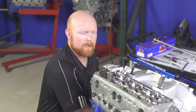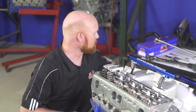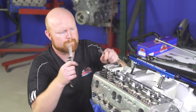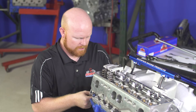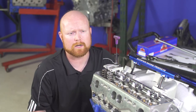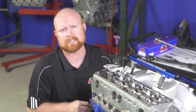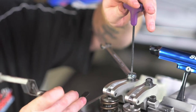Once we have the full torque set, we can go ahead and set our rough valve lash. When setting your valve lash, you'll need your feeler gauge, your box end 7/16ths wrench, and your Allen wrench. Insert the feeler gauge between the valve tip and the roller of the rocker. Based on your camshaft profile, this allows lash in the system so that at high RPM you don't get binding issues, valve float, valve-to-piston interference, and bad harmonics. Look at your manufacturer's cam card for the valve lash spec — it's probably spec'd as hot lash, so if you're setting lash cold as we are here, adjust by about four to six thousandths to compensate for temperature difference. For example, if your cam card says twenty thousandths hot, when setting it cold you're going to want to set it to twenty-four to twenty-six thousandths.